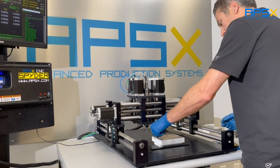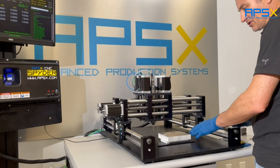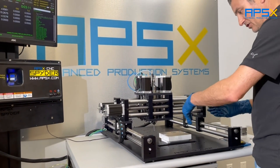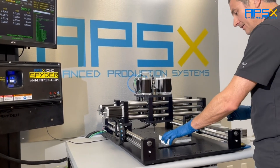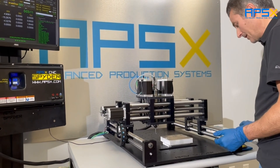So if there's a part that you make often, you might want to consider using a jig yourself. Depending on what the part is, you make your own jig and face it first, and then you place your parts and bolt them on — it makes it really easy if you have the option to do that.